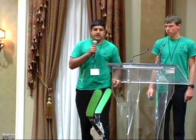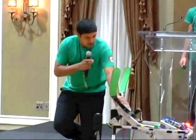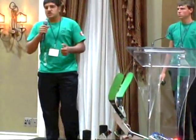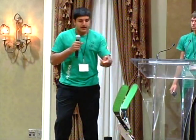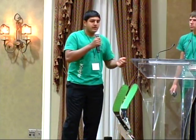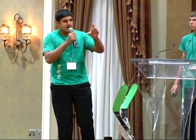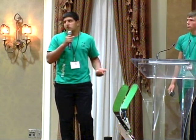Another thing is we have safeties for our catapult. The system will pull it down, and then once it's down, all the gear needs to do is turn an extra 1/8, and that'll launch the catapult. But no one wants to sit there and watch the robot and time it, so they have to let go. So we have 2 different buttons. One button will pull the arm down by rotating the gear. But when it gets to a certain point, the sensor will pick it up, and it'll stop. If you press that button anymore, it won't do anything. A different button will turn it that extra 1/8 of a rotation and launch the catapult. By doing this, we don't have any fires when we don't want them.